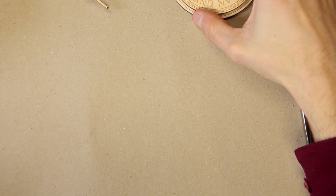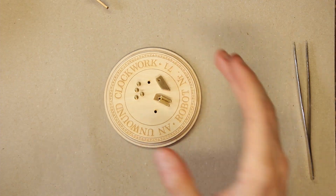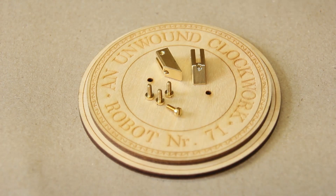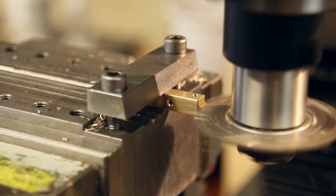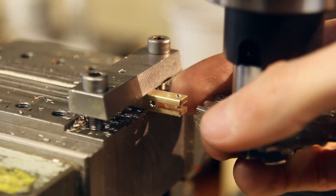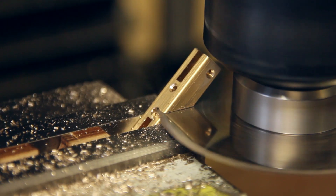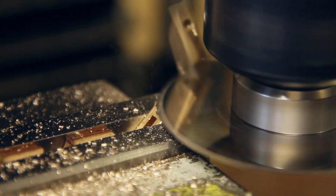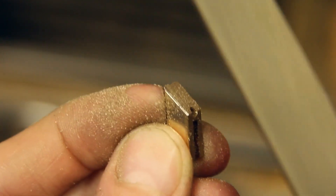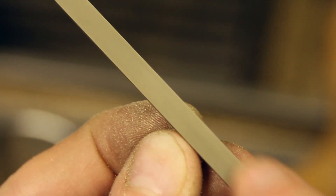For the new parts, what you're getting this month are the feet of the character, four 6mm screws, and this wooden disc which is laser cut and engraved. It serves as a little plate where he can stand on if you want to present him. The main geometry of the feet was created on my manual mill, but I also spent a lot of time hand filing all the surfaces and creating 45-degree beveled edges on the feet, which gives the entire thing a very nice precise geometric look.